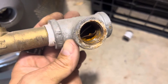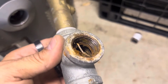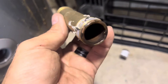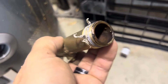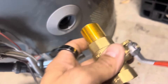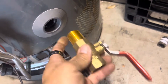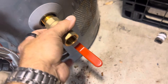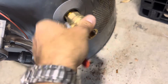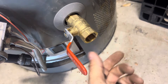You can see how nasty the galvanized is inside of there. This drain valve is the same age, and even though it's dirty from that nasty water, there's no corrosion inside on the brass. So try to use brass — a three-quarter inch brass pipe extension right here. On this side, use pipe dope and teflon tape to seal it up and install it on the bottom of your heater.